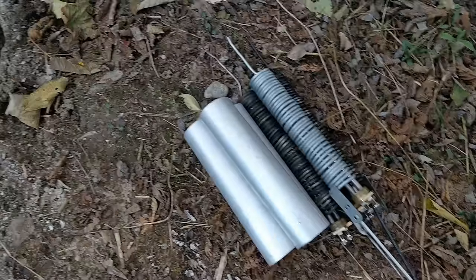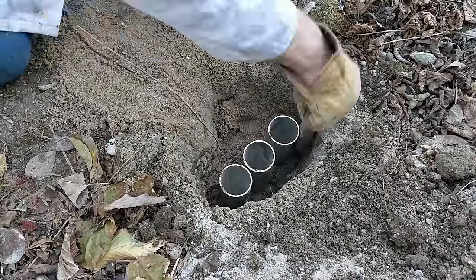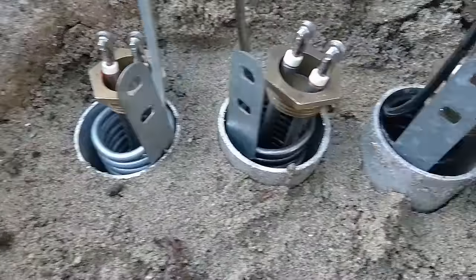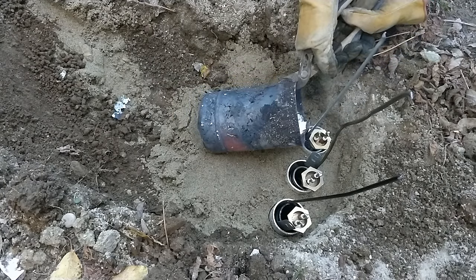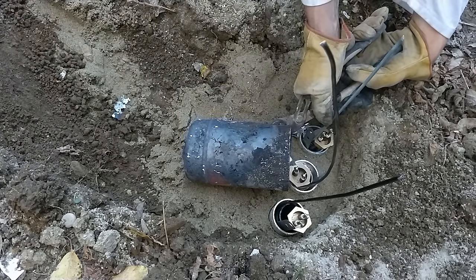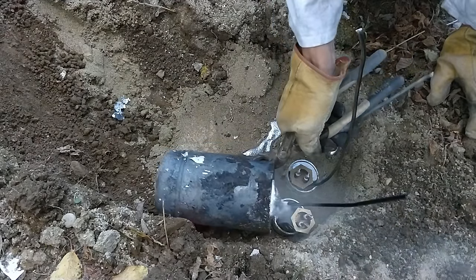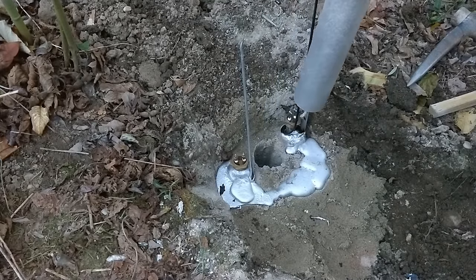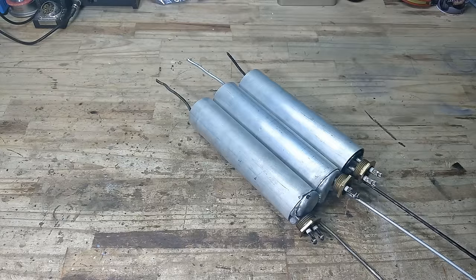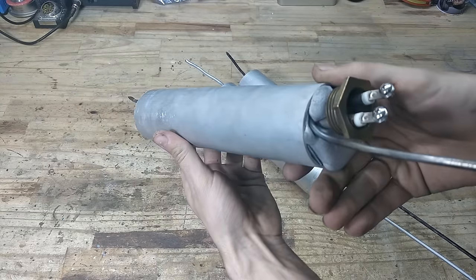While the aluminium was melting, I dug a hole in the ground and used sand to hold everything in place. Next I filled up the three tubes with molten aluminium. I didn't really do a great job at that — I was so terrified I just wanted to get it over with. The more aluminium used, the longer the heating block takes to heat up, but also the longer it takes to cool down below 175 degrees, so the longer the machine can run. And voilà — three heating blocks ready to be used!